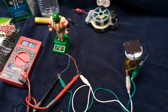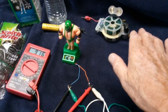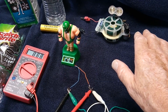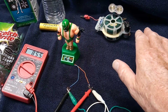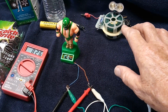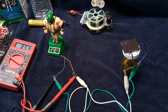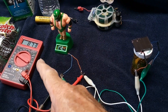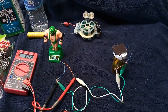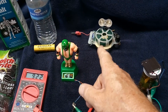Let me show you what happens when I shade this thing and how the voltage starts going down on the cell. The little device will run till about 0.7 volts, then it stops — the little LED oscillator goes down to about half a volt. Now I'll uncover this again, and you can see the voltage start to climb back up. This is just ambient sunlight in my kitchen.